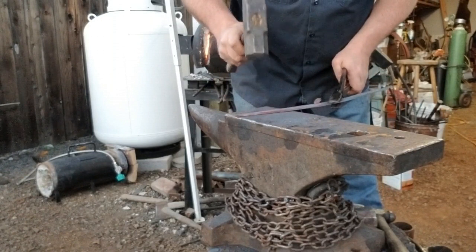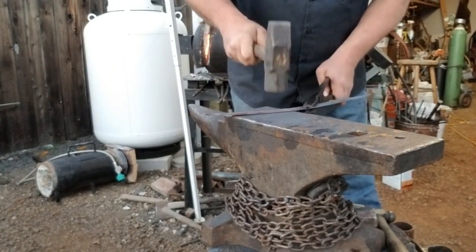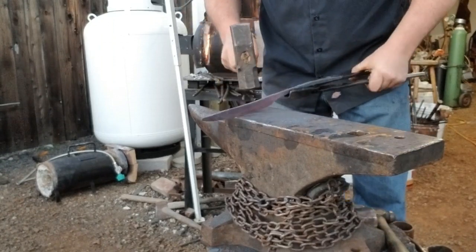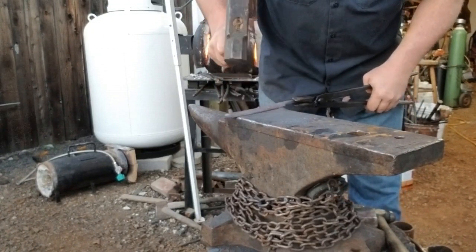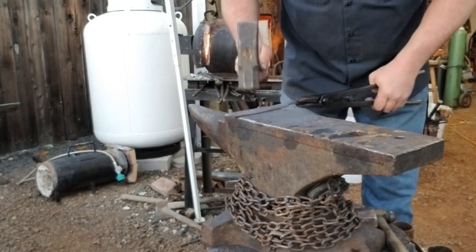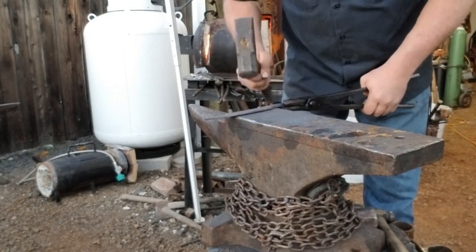All I'm doing is fine tuning. If I see a part that's a little fatter on the bevel, I go ahead and hammer it. I round off the edges of the back of the knife and look at it — looking down it, things should be flat. I want to keep that blade as flat as possible. If I can do that and keep the cutting edge right down the middle, this thing will be a cutter.